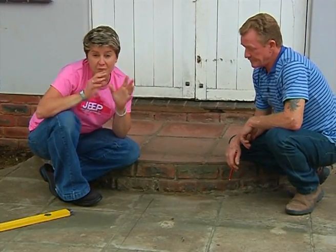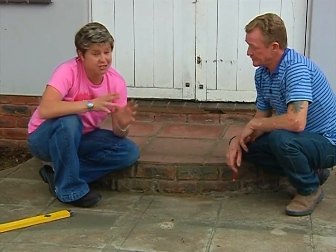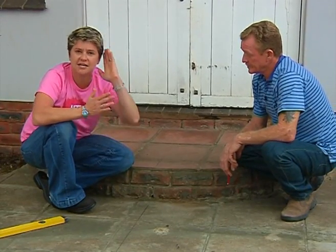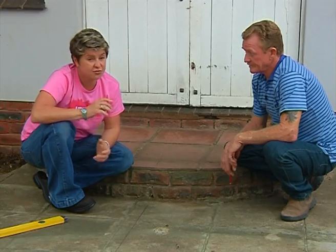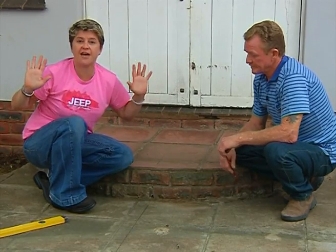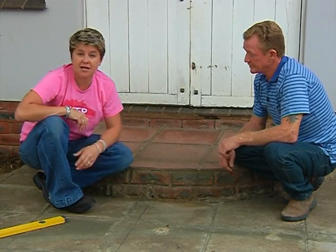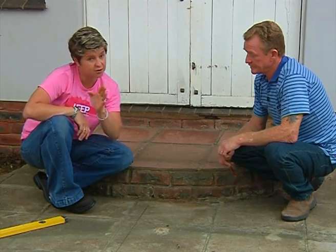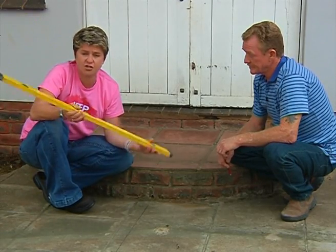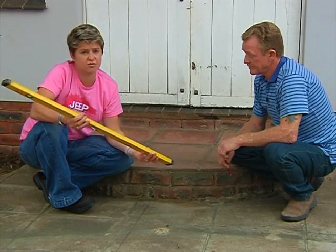Remember though, if you are working at home with a patio that maybe does not have a house alongside it or any type of straight wall, it's really important that you do work your central point and get that right. Start from whatever wall you have and walk away from that. That really is critical, else you end up with your lines going crooked.